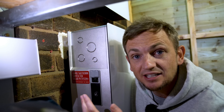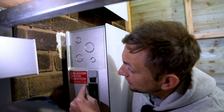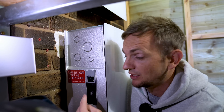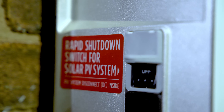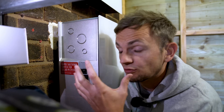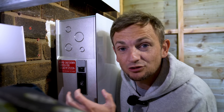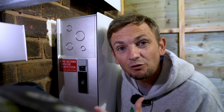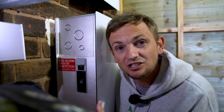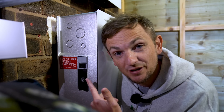You might bring your DC in there or your AC — it's totally up to your installer. While you're down here, you've also got a rapid shutdown switch so in case of emergency you can isolate your Tesla immediately. And look at the finish on this case — it looks to me like a Cybertruck, that exposed metal finish. There are rumours Tesla are going to change this and start powder coating the cases, but this finish looks brilliant. There are also knockouts on the other side and a DC isolator there as well, so you'll be pretty unfortunate if you can't find a way to make the cabling work.